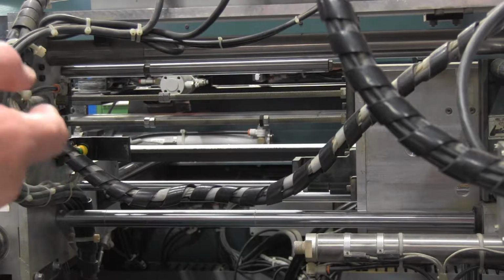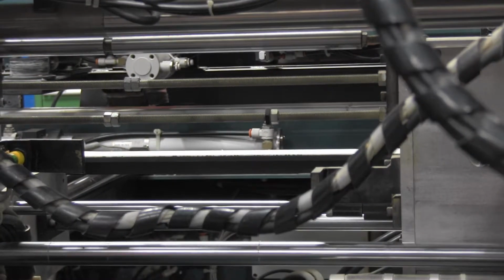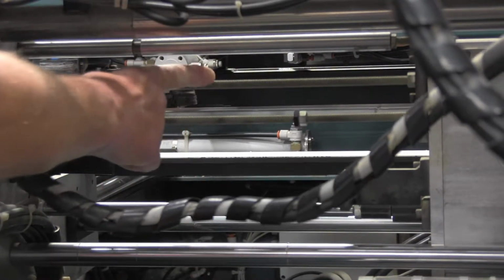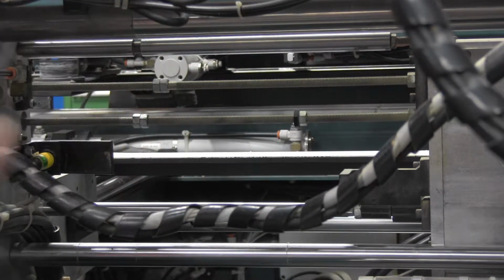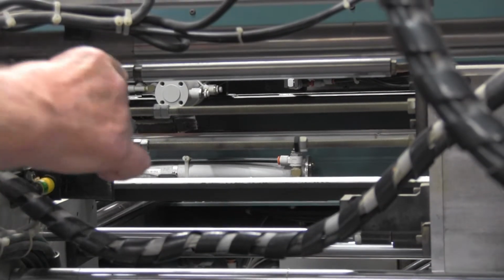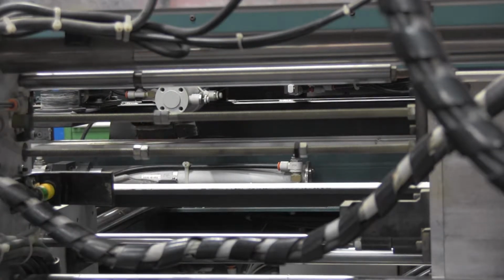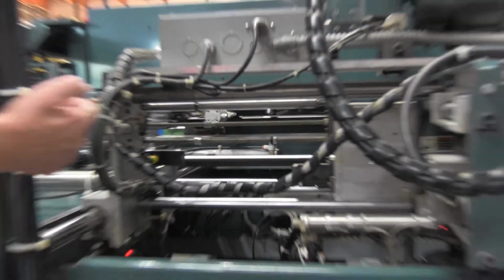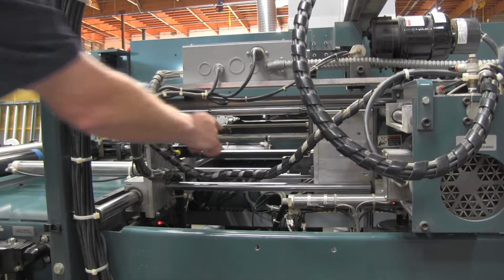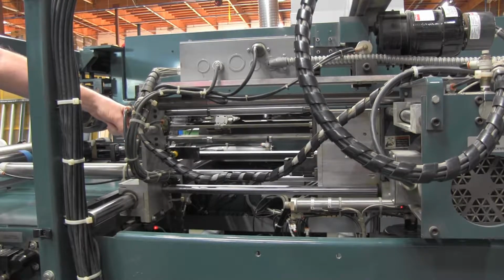In this video, we're going to talk about the lock drill locations on a 5000 machine. These rods right here are the stops for the lock drill locations, both left and right, deadbolt, and center bore. Right now, it's set to machine a door with the head of the door toward the outfeed end of the machine. This upper stop rod is the one that is controlling it, and there's a nut on the outside that's up against the plate.